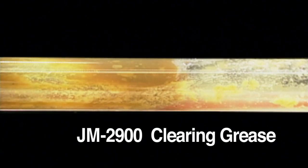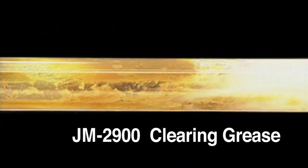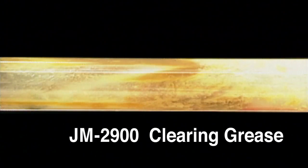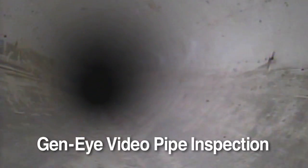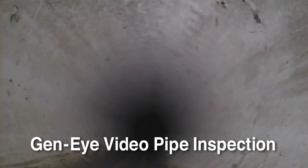Water jets use a stream of high-pressure water that hits the stoppage and flushes it away. The thrust of the jet nozzle drives the hose down the line and gives you wall-to-wall cleaning action. We have a camera that also goes down through the drains, and when you're finished with the General jet, the drains are as good as new. You can actually read the writing on the inside of the piping.